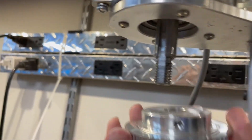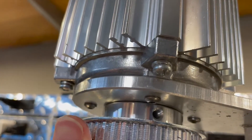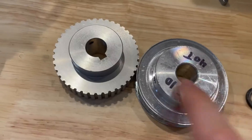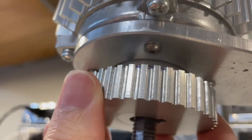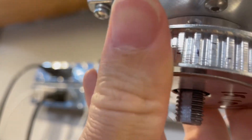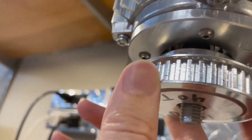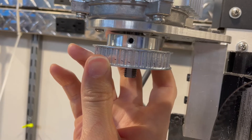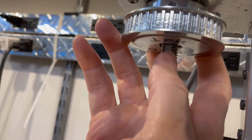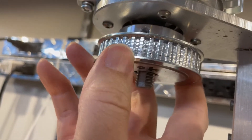Here's the eBay pulley. The diameter of the hubs is much different. This one fits inside, but this one does not — the spacer won't fix that. So if you want to use this pulley, it looks like you have to open up this hole here. Or you can put it lower on the shaft, but then it won't rest against the shoulder. So that's not a good design, but you can try it.